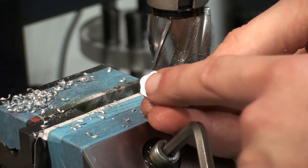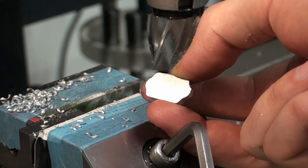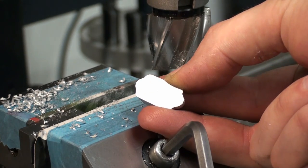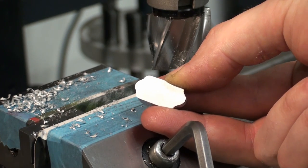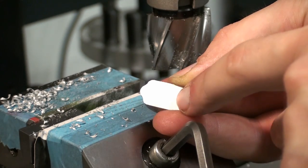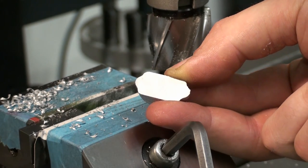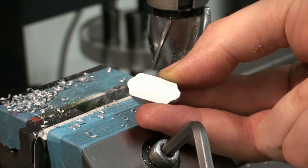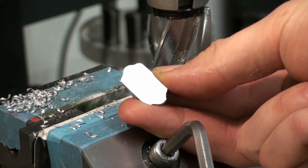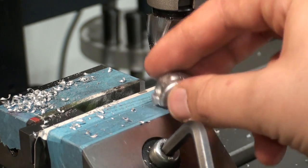And also what to notice on those castings, there are very few gas bubbles. A lot of times when you see backyard foundry pieces or parts, you see a million little gas bubbles in the aluminum that look like small black spots about a tenth of a millimeter in diameter. And on those castings, there is practically none. And that's due to the degassing with argon.